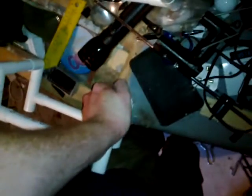And then when I've got all the bits lined up and square, I'm just going to pre-drill and screw each join. Where it's screw-jointed, I can take it apart, extend it, shrink it, add another section, make it longer, turn it into a backpack. If I glue it all up, it's going to be glued up, and the only way to break it is by cutting bits out. So I'm just going to go around and squash them all together for the second time. I've done it the first time, but I'm going to doubly check they're all pushed in.